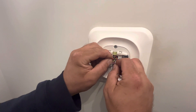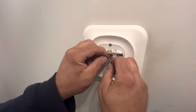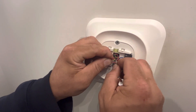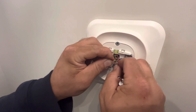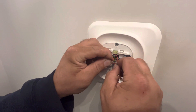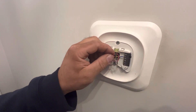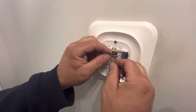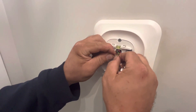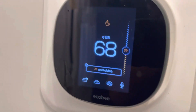Right now my boiler is kicking on and kicking off. So it tells me my thermostat's bad, or my thermostat's not sending the signal. I went ahead and reconfigured. It's on — right? And now it's off? Now it's on? Okay. I just put the R and W back in. Let's see if maybe that wasn't the problem.